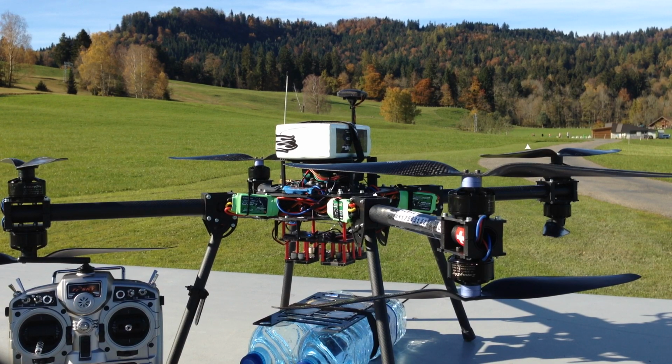Okay guys, these are the instructions on how you operate the system. Now, for both payload systems, the MAX or the 1 kilogram system, you need a 5-volt input and a PWM signal. Now for the 1 kilogram system, the easiest way to do this is to attach it to your receiver and power it that way. The safest option is to use a BEC and a single signal wire out to your receiver. So you're still going to need one channel on your receiver at all times, but you need a nice consistent 5 volts to the unit.